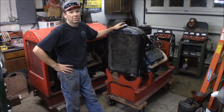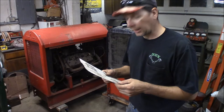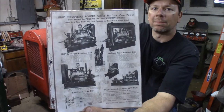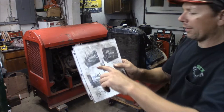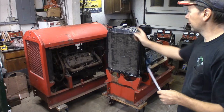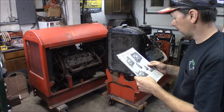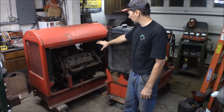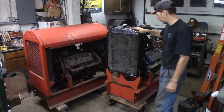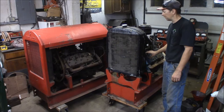The guy had a pamphlet for the KR Wilson units. This one on the left is the Guardian — it's the indoor unit that would have been in a mechanical room of a hospital or a factory to run equipment. This one would be an outside enclosed-type unit with a hood on it. Basically what KR Wilson out of Buffalo would do is buy the Ford engines and manufacture all the framework — you get the truck radiator; these are truck blocks with 81T heads on truck engine blocks.